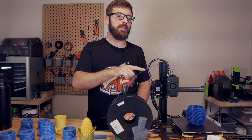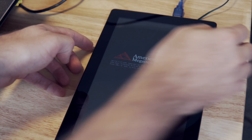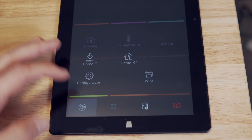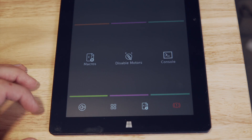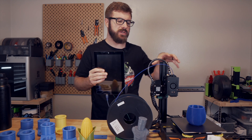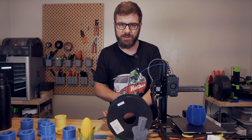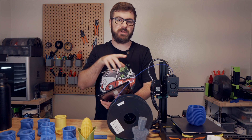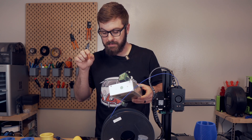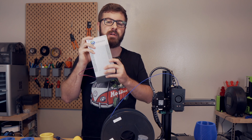The plan was to install Klipper on the KP3S, and after quite a bit of trial and error I was actually able to get Klipper to install on an old Windows tablet — I have a handful of these that were headed to the e-recycling facility. I was also able to figure out how to run KlipperScreen, so I've been using this massive touchscreen to interface with the printer. These tablets didn't come with batteries, so I soldered wires directly to the inside of the tablet and ran them through a 5 volt buck converter, so the tablet is 100% powered off of the printer's PSU.